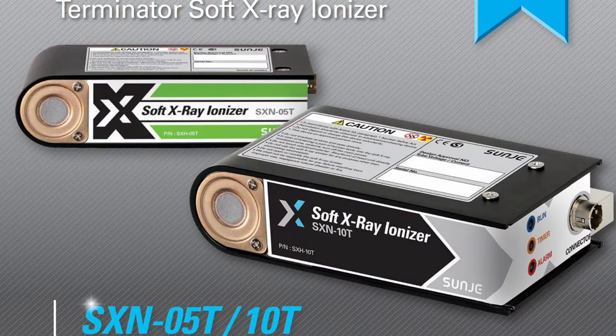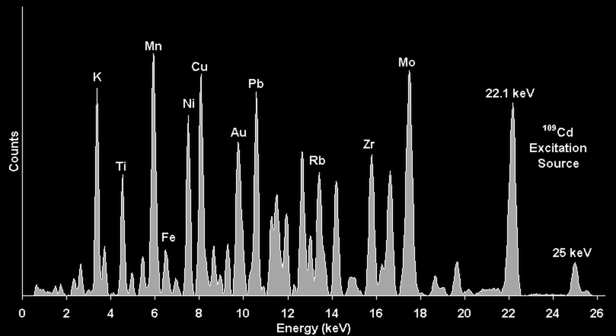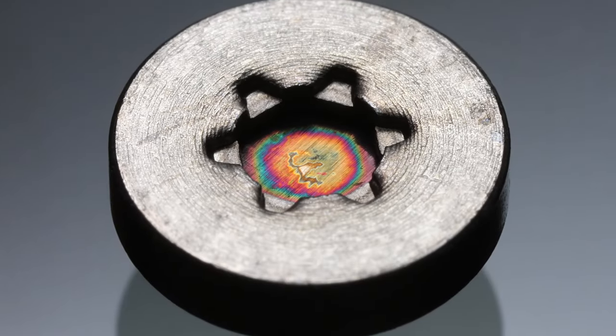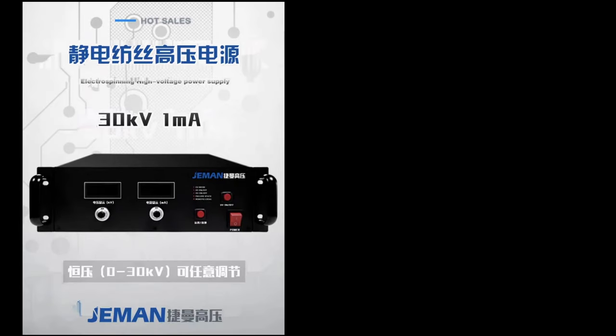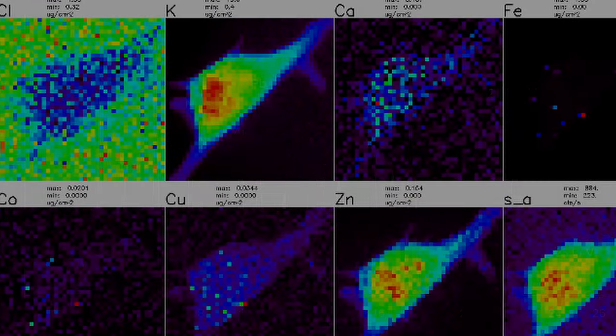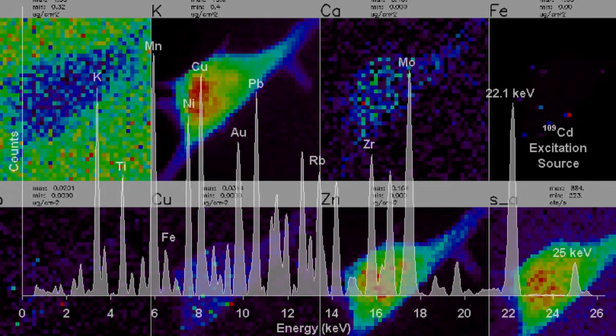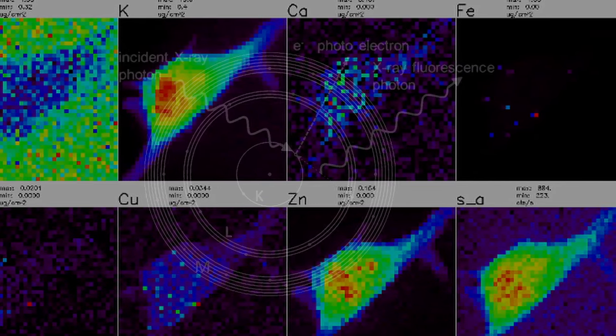As well as this 10 kV unit, this manufacturer also makes a 5 kV version. Some people might think it odd that I want to produce such low energy x-rays — the purpose of this x-ray source is to test the lower boundaries of the energy levels of typical gamma ray detectors. I already have higher energy level sources such as americium-241. Once I have a better power supply, I will be able to experiment to find the limits of the operating range of this tube without the fear of a failure. I also want to test my theory that I am seeing some x-ray fluorescence, which would open up some really interesting experiments.